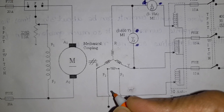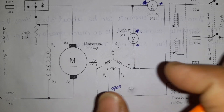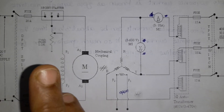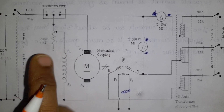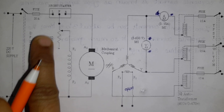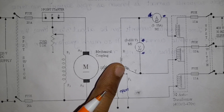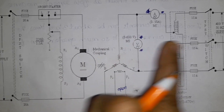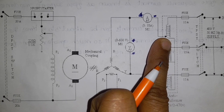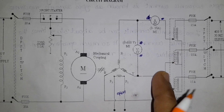The alternator field is open. The TPST switch will be in the closed position. As the working principle: first, the DPST switch is closed, giving DC supply to the motor. The 3-point starter is started, and the motor begins to run. The coupling connects the motor to the alternator, so the alternator also starts to rotate. Then the 3-phase AC supply is applied and the auto transformer is brought in — starting from minimum position and gradually increasing to maximum.